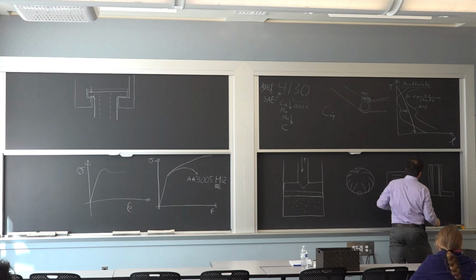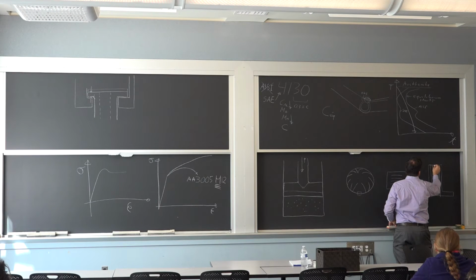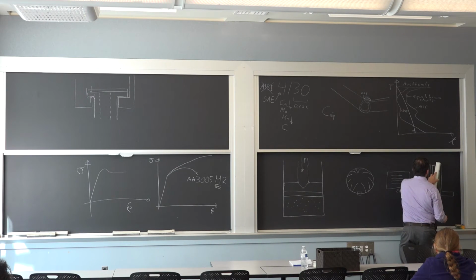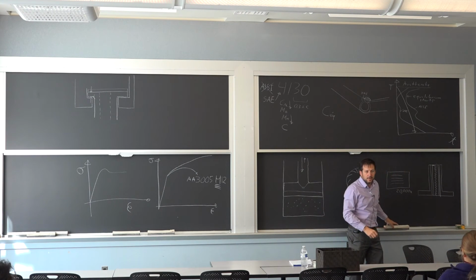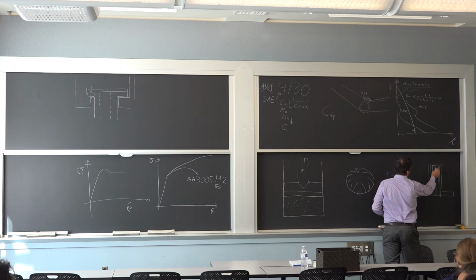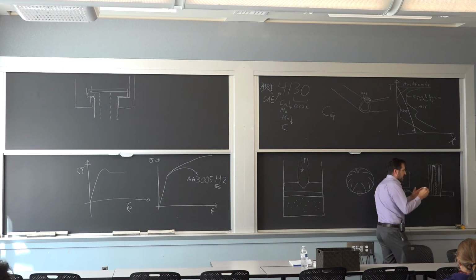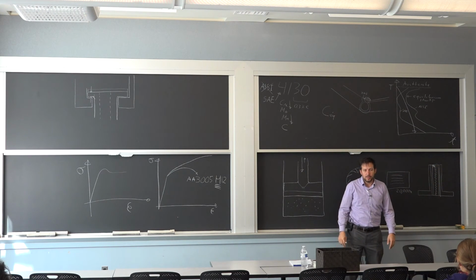What you'll see is there's a center column. It has a hole in it, but the point is there's one strut that's holding that center column to one side. If you look on the other side, you are able to build these features to hold the center here, but it has to be done gradually. So we had to build it up from each side at an angle and gradually add more material.